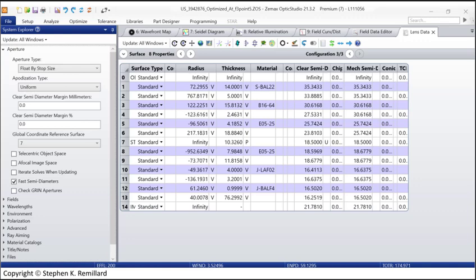One other thing that I did when setting this up was I substituted the glass properties from the patent with closely matching real glasses. Something that I didn't do was allow the glass selections to float during optimization, which would have produced an even better outcome.